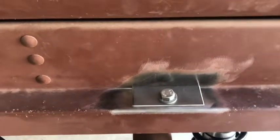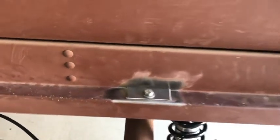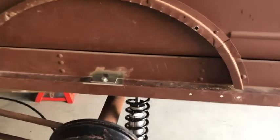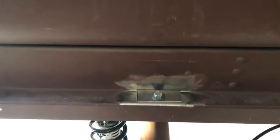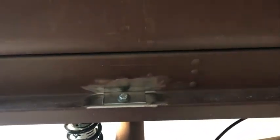I made these as locators for the position of the bed. The holes in the original piece were tight and left me no adjustment to get equal dimensions on both sides. So I hogged out the holes to give enough adjustment and got the bed equal on both sides. Then I made those little plates — eighth inch thick with a tight three-eighths hole — and I'm going to weld those plates in place to the red piece, as locators essentially.